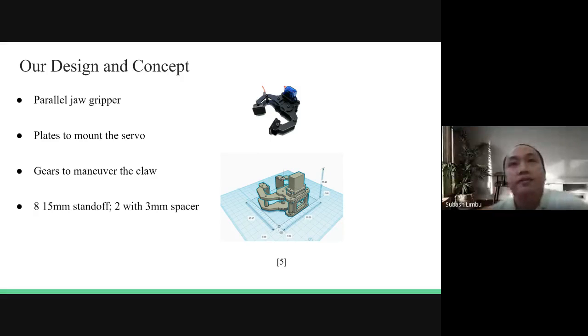As Dean has mentioned, our four-prong gripper did not cooperate with our PCB design due to the DC motor use, but we were able to design a 3D model that can work with our standard motor. We redesigned the 3D model to fit our design using 3D modeling software, where the top plates and the spacers' dimensions were reconfigured to adjust to our standard servo.